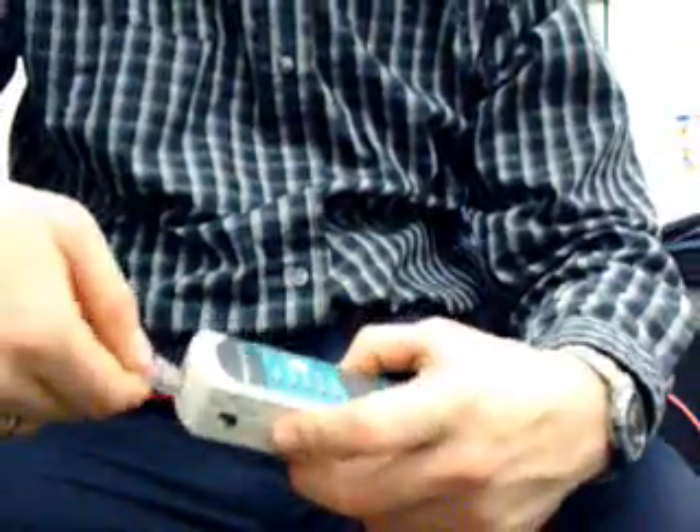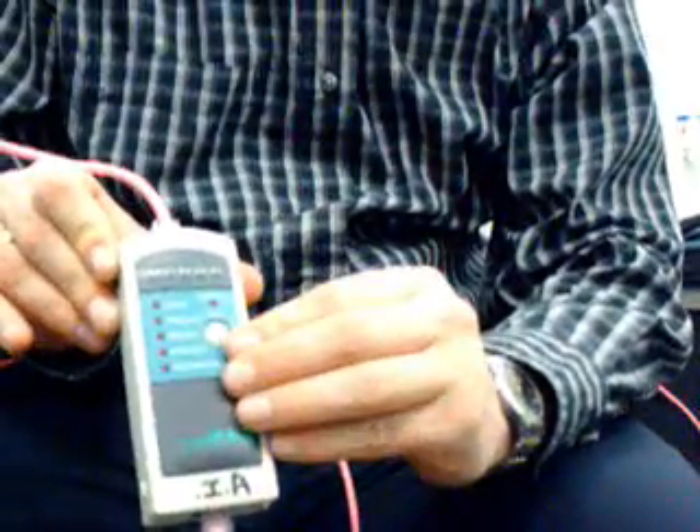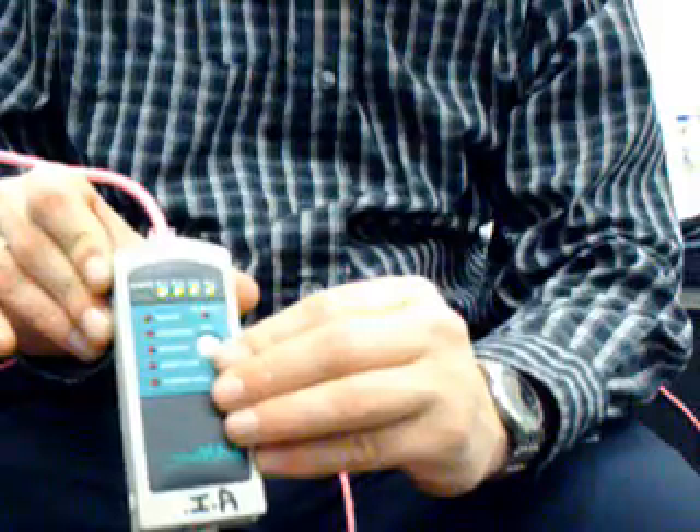Check your order, and then we'll test the wire. I've already completed the other end of this wire, so all we're going to do is put it in the tester. Keep in mind that different testers have different settings. This particular tester, which is a fox and hound tester, has a signal and cable setting. It also has a receiver and sender, just like most testers. I have it set to cable, and I press the test button. Note that all four lights are green and solid, meaning that the wire is good.